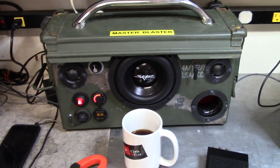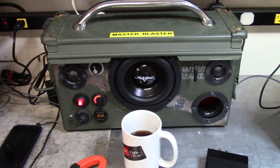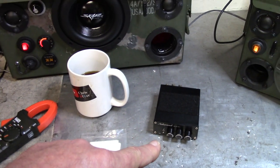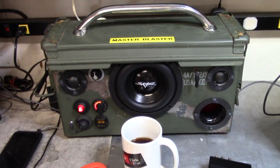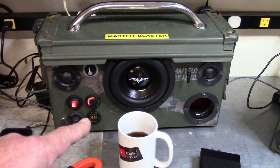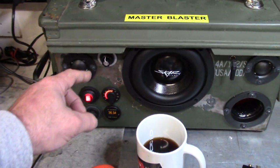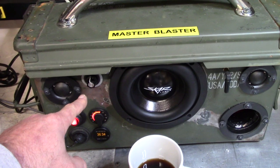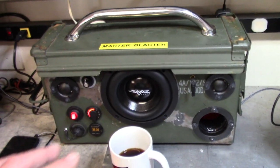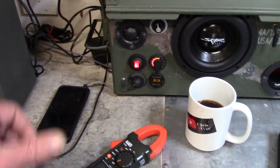And this one has about 70 watts RMS times two digital chip amplifier. Not this one right here — it's its big brother, rated like 160 watts per channel, but total nonsense, good for about 70. And on this build it had volume control, which is really nice to have when you have AUX input. Now with Bluetooth it doesn't matter — you just use your phone and it controls the volume.